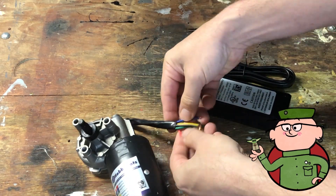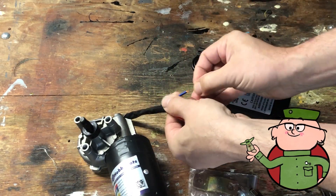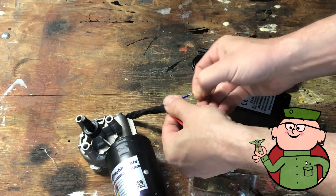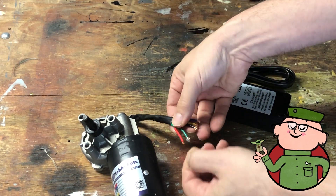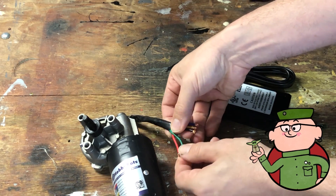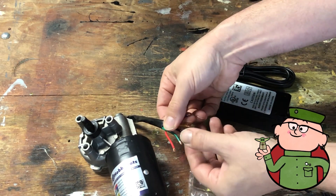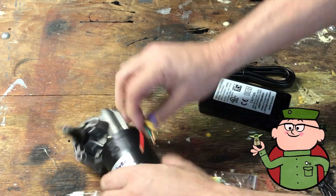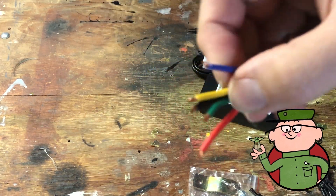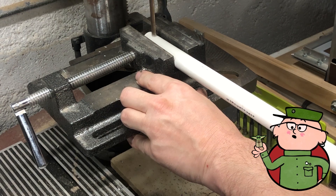For the negative, you can choose either the blue wire for fast speed or the green for a slower speed. The yellow and black wires are for parking — I think it has something to do with the ability to stop the motor at a specific point if you have some sort of special adapter to go with it. It's not something I'm gonna mess with right now, but it's nice to know that I have that option.